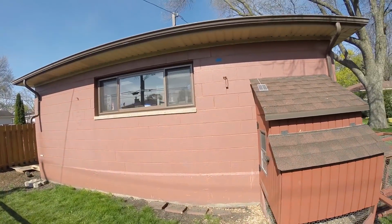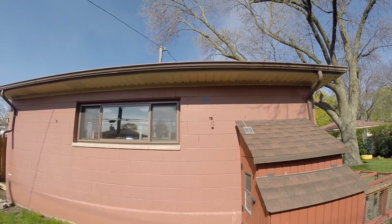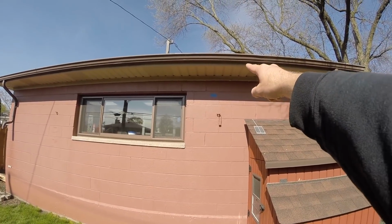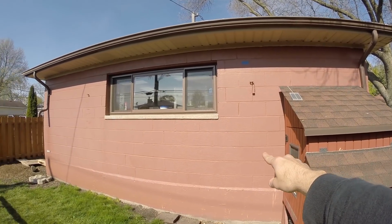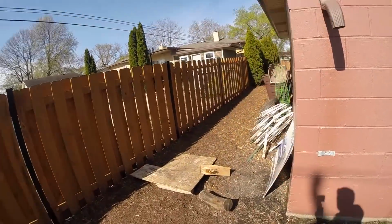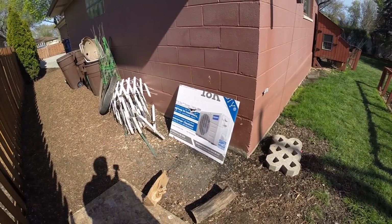okay, so back here, that piece of blue masking tape you see there is where the hole would be, where the template is placed inside. So that'd be the hole. I would have a vertical run of the line set, and then it would transition to horizontal somewhere in this space here, all the way across. And then the condenser outside unit would go right here.